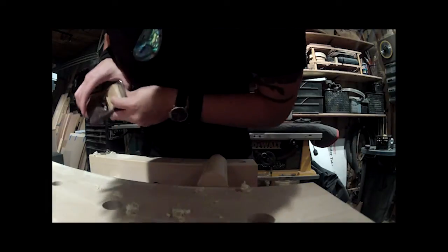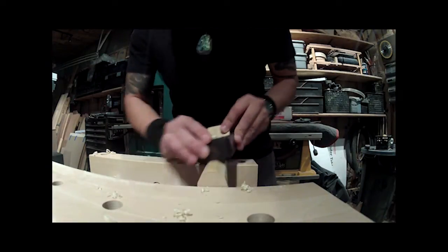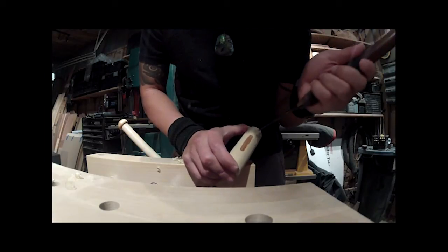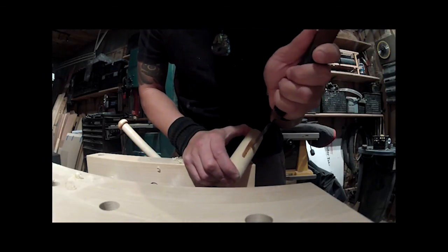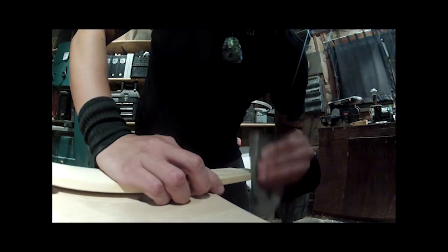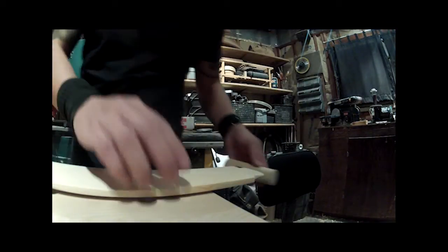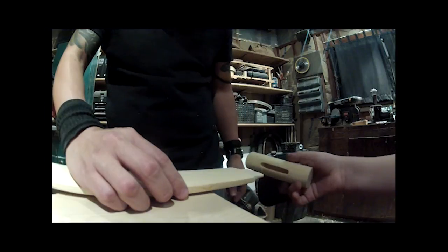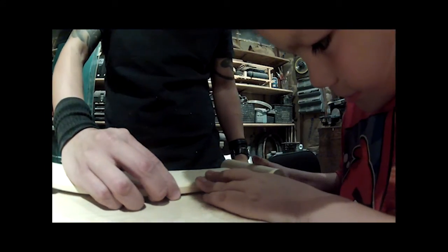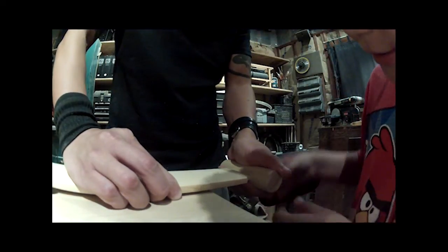That was my son there in the shop — he's in the shop with me quite a bit. I'm using a hand plane to shape the handle there, cleaning out some of the switching grain inside there from the hollow. This is the taper of the blade that goes into the handle on the lower end, and that was actually shaped down further with a crooked knife and a straight knife, just smoothing it down with sandpaper. My son — my best shop helper ever — comes in and makes sure that I'm doing it right from time to time.